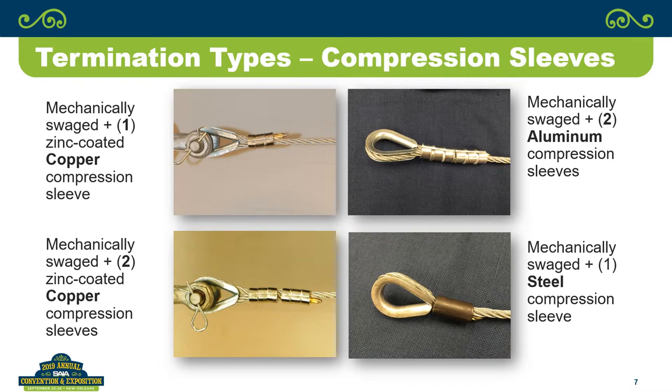On the aluminum, I talked years ago to National Telephone Wire, whoever makes those, a lot of those sleeves that had the specs on them. He said aluminum should be used with aluminum because that's what power companies use for power lines. And they said the other problem they have is the aluminum and steel galvanic reaction in a wet and salty atmosphere.